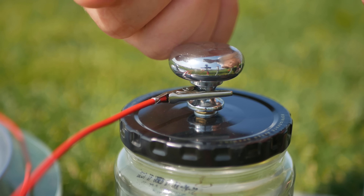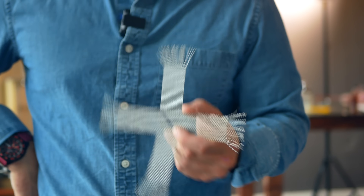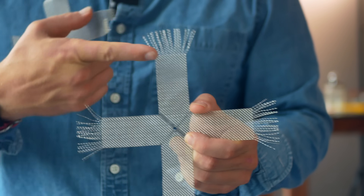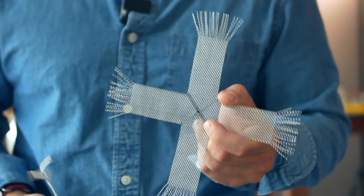You could hear the static on the wire and the top of the electroscope, which tells us there's potential here. Jordan and I were talking — it's pretty humid today, so there's a strong chance the humidity is leaching away some of that charge. I think I need more charge, and therefore a bigger electrode. This was the original electrode — didn't work well. Today I'm trying this one: twice as many ionization points and double the surface area to collect energy out of the sky.